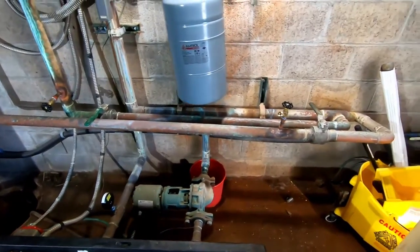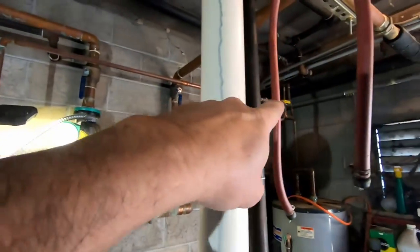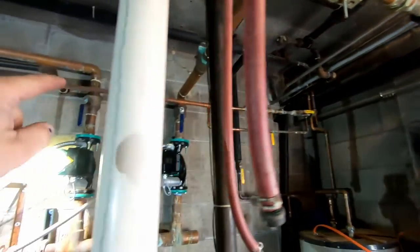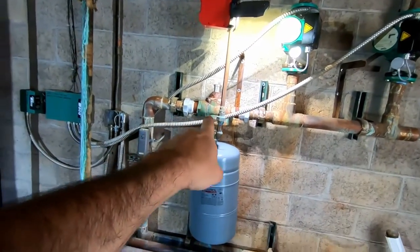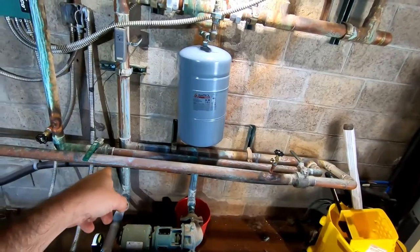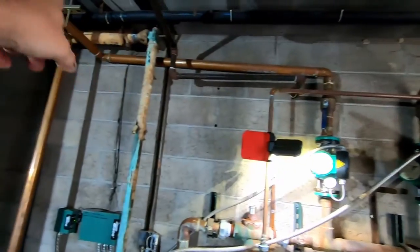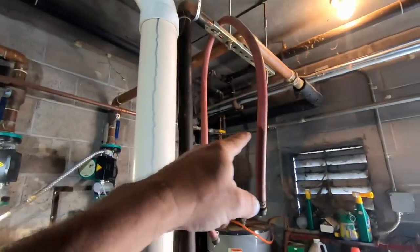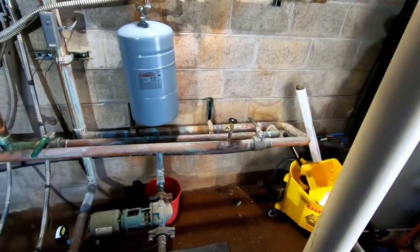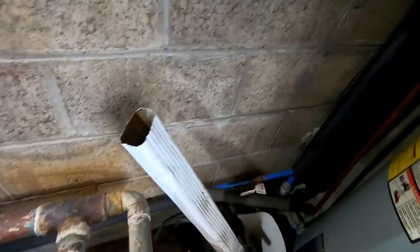We've got that valve off there and that valve off there. The water is going to come in from the water heater, bypass the fill valve, come in and go into the auto bleed, go down to here, come back to these pipes, and then stop. Its only choice then is to go through the circulator pumps, out to the loop and around that way, then eventually return back to here. It won't get all of the air, but it's going to get a good majority of it out.